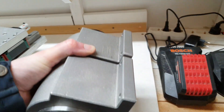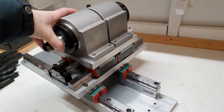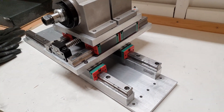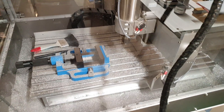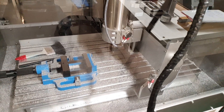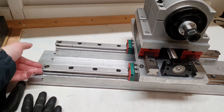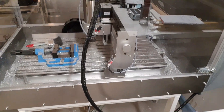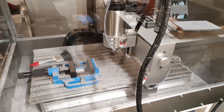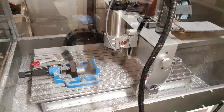This is a pretty heavy piece as well. What's left to do now is to get all the chips out of the enclosure and from the router, take the gantry out, put it on the table, and bolt the sides of the gantry onto here and from behind into the gantry. Pretty close to getting it together, but it will be interesting to see if my poor NEMA 23's will be able to slide the rails — I'm a bit worried about that.